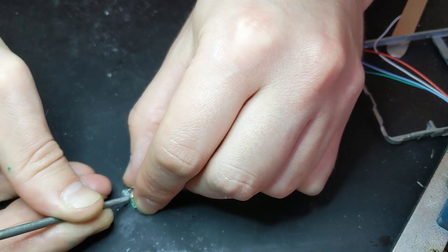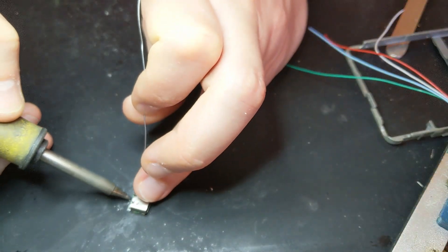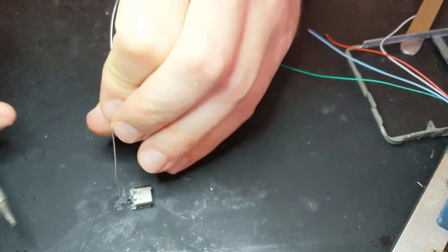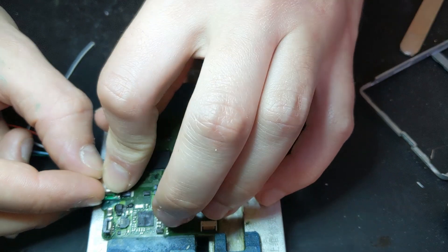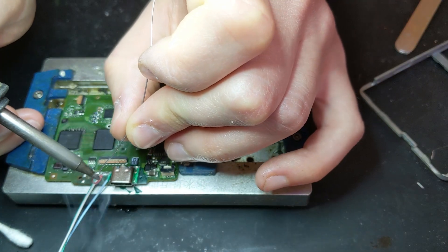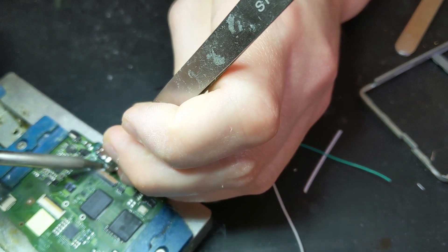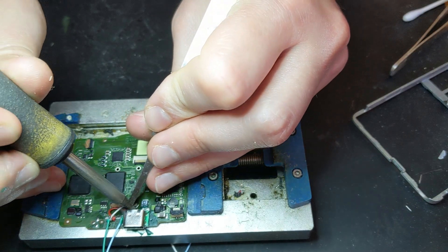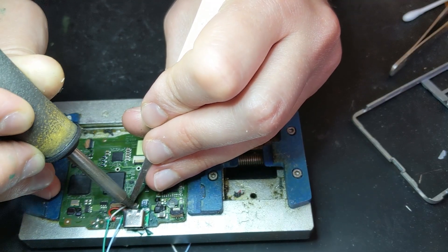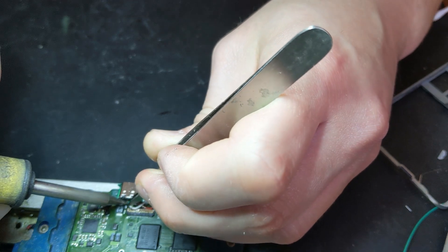It didn't work — the port peeled straight off the moment I tried plugging it in, so the super glue on the solder mask didn't adhere at all. I also tinned the back pads and scraped away some PCB to make soldering easier. After gluing it on I cut the wires very short to save as much space as possible, but this resulted in an extremely tight fit with the hard drive connector — too tight, and I wouldn't recommend this approach.